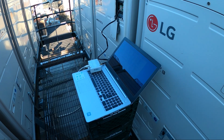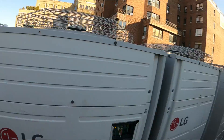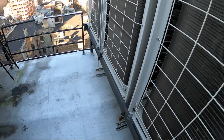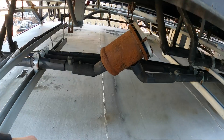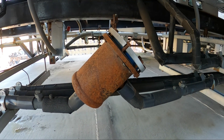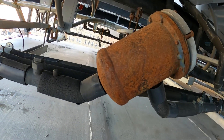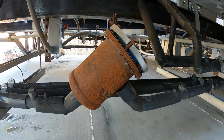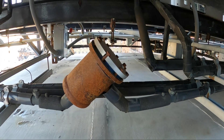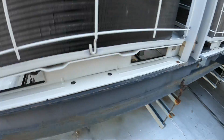There's a serious problem, and I know that the condition of the indoor units is playing a role. Not only that — we've got suction line filter dryers installed at a weird angle. I've opened these up before during a compressor change-out and there's no filter left in there. Look at these — they're just rusting away with no filter remaining.